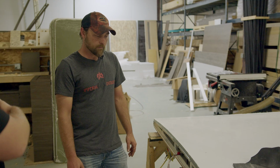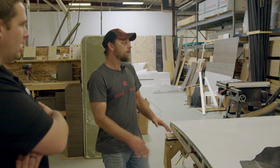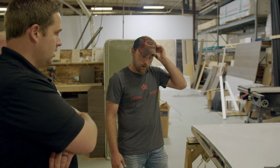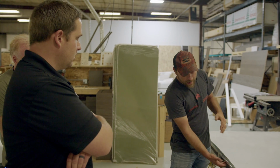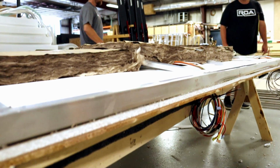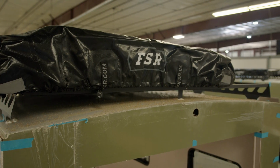And it's also good for runoff. The obvious reasons you want a radius roof are moisture runoff, but it also creates a cavity for added insulation and for wiring and routing of things. So that's another reason for the arch, but a big part of it is strength. That's what makes it so strong.